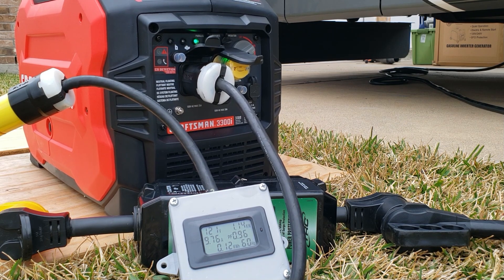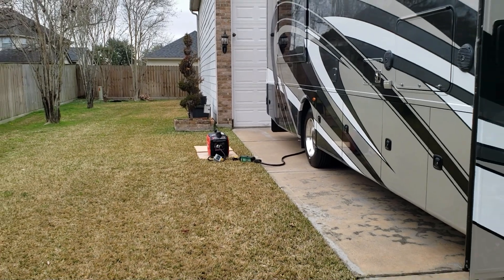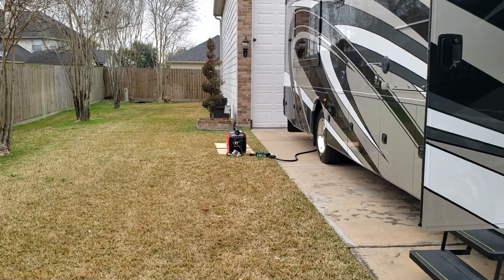Let's go for the overload. I have the AC running and the refrigerator on. Let's try turning on a small heater — that should overload it. Remember, she handles 2500 watts — we've got 2650, and now 2700 watts. That's considered full load. We have the overload light flashing. Quick dB test: right at 63 dB on full load.